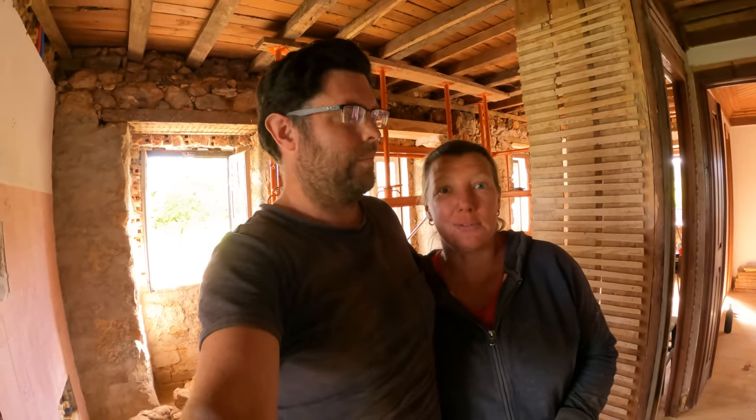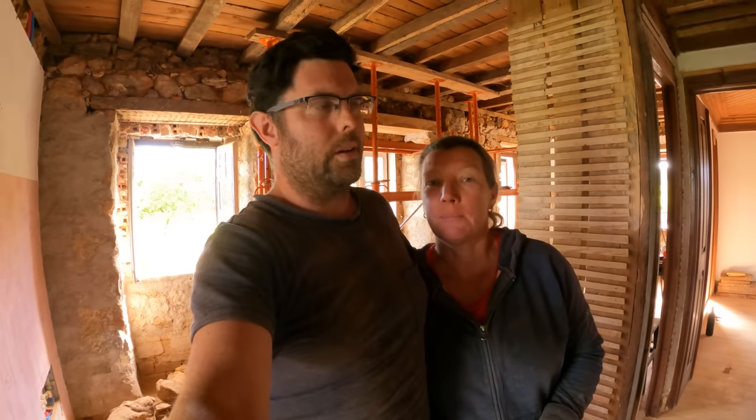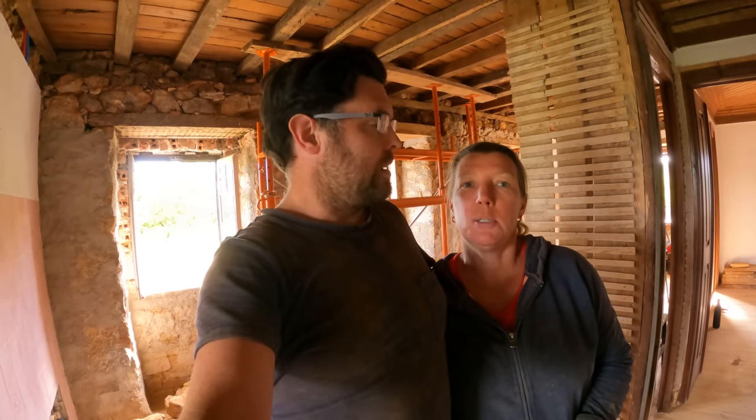Yeah. That was a tough one. But it looks amazing. So worth it. So glad that we, first of all, restored the lintel. Yeah. But so glad to have replaced that lintel now that we've pulled that out. It's much worse condition than I thought it was. Yeah, it was crazy to see the one that was there originally. And also this lime, it's like frosting a cake. It is so sticky and smooth and silky and lovely. And it takes a really long time to cure as well, which means you have time to come back and rework it. Yeah.